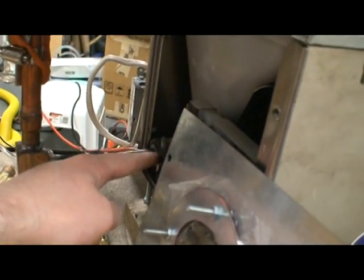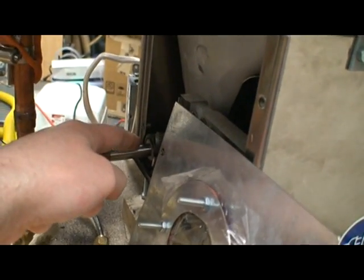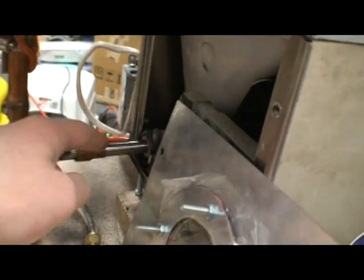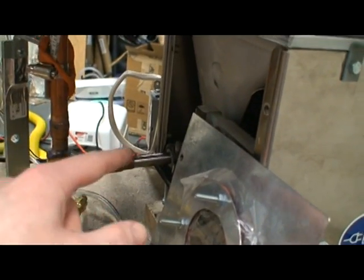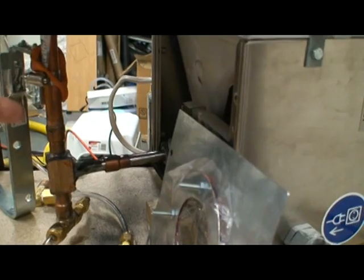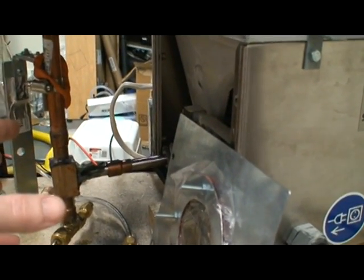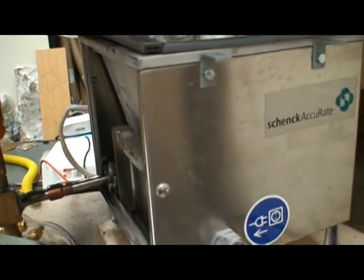so it's got a nylon washer in it, pipe clamps to the rubber hopper kind of extruded point here. And so if this stainless steel isn't aligned up exactly with the Helix, and the Helix actually rubs on the stainless steel at some points in its rotation, that'll mess with the speed of the Helix itself based on the motor power.